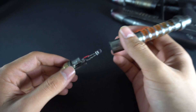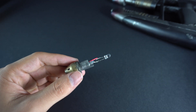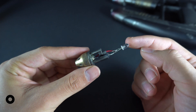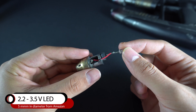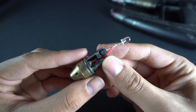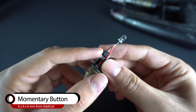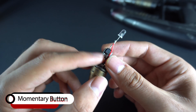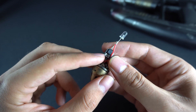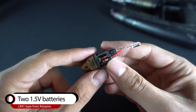It slides out in a single piece. So this piece holds the entire LED circuit. It has an LED which is around three volts, with the positive and negative wires, and then very importantly a six millimeter button that I got on Adafruit. You can get any button you want as long as it is six millimeters by six millimeters by six millimeters.